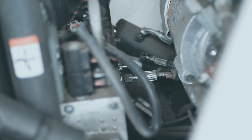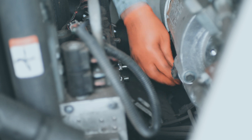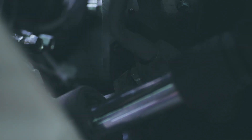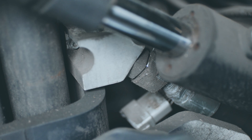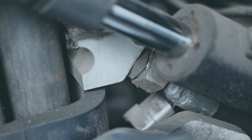The easiest part here is to go ahead and take the mast off. I'm taking off the accessory hydraulic hoses and disconnecting all the hydraulic hoses and the two electrical connectors on this unit. Then I'll show you how I remove the tilt cylinder rods — I actually don't take any of the pins out because that always leads to problems when putting them back in.